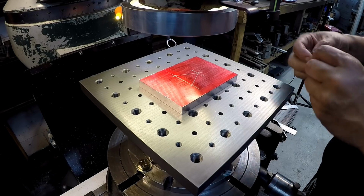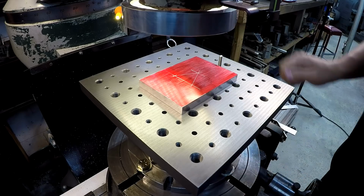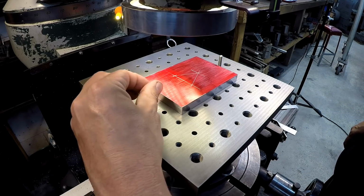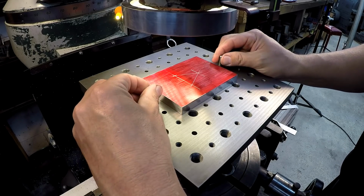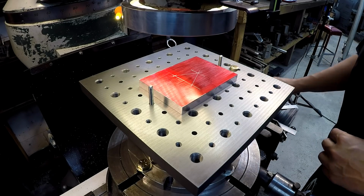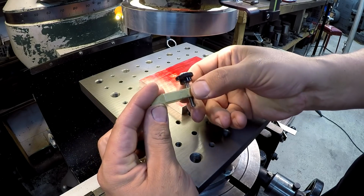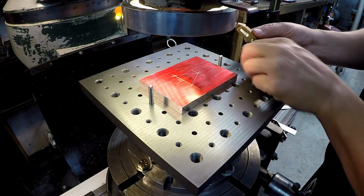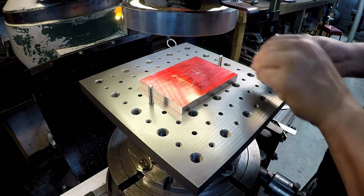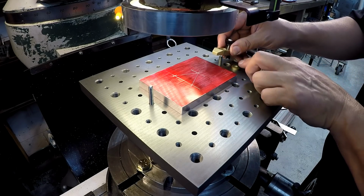All right, and then we're going to use the quarter-inch holes. I've got these little studs. These are just made out of 1/4-inch all thread. Got different lengths cut up, and then my little kit. Got the heel pad, and then this is the actual clamp right there. It's got a screw that adjusts the heel of it, and that's what sits in this little brass washer right there. Protects the surface from the screw getting into the surface there. Also got some springs that you could put in there also that helps keep these things kicked up if you want to use them that way.